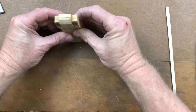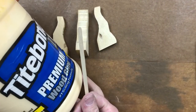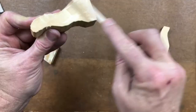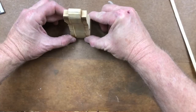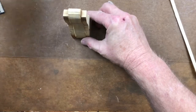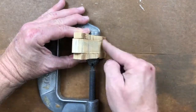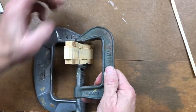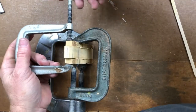Got the wood cut out. Break out the old Titebond, get some glue going, get the surfaces nicely wetted out. Let's pop these into the clamps. Put some pressure on the clamp — clamp number two. Make sure the parts don't go walking, don't go creeping. And one more clamp on the tips isn't going to hurt anything.